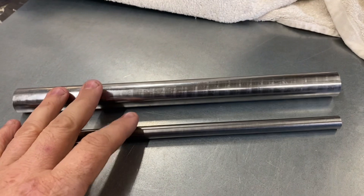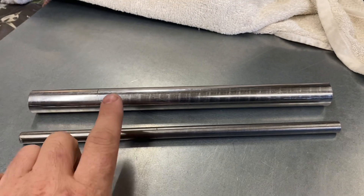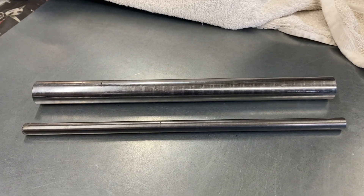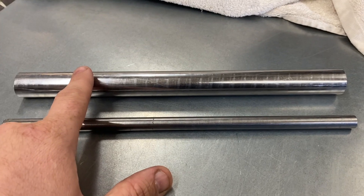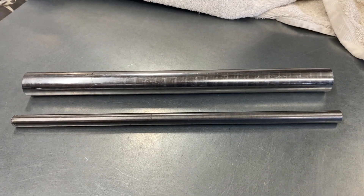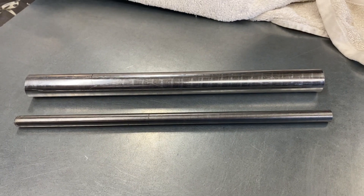This steel is also the same steel that classic Mini crankshafts are made from, so it's good stuff. It's not the same as EN24, but for a medium carbon low alloy steel this will take to the flame hardening much better than EN24 would. Also the bar is already in half-hard condition - that's what the T stands for. T condition basically means it's already around 28 to 30 Rockwell C, and hopefully we'll be taking the hexagon drive up to around 50, so we'll end up with a nice hard, wear-resistant tool.